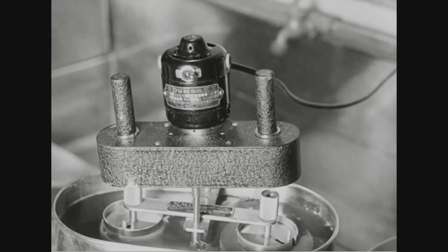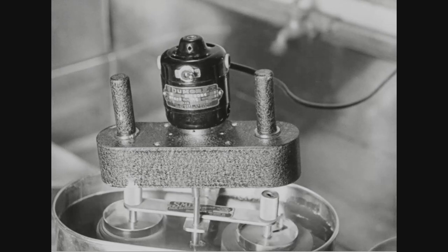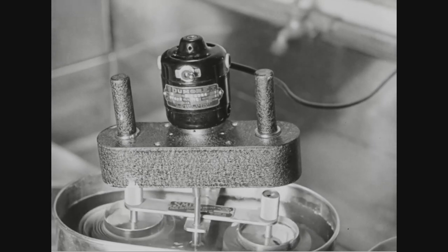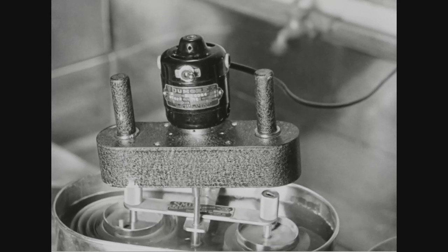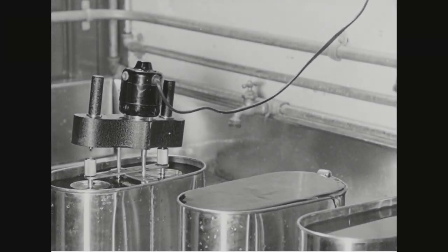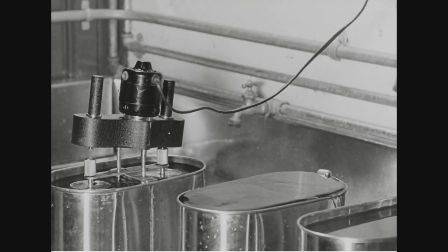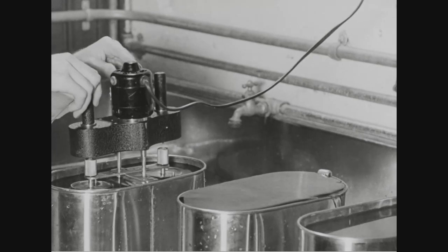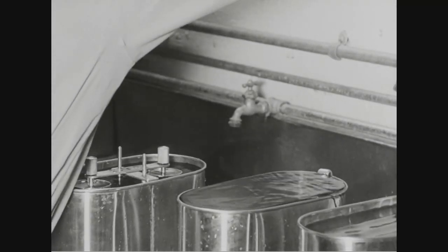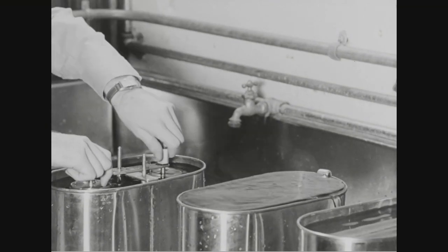When all of the film has been transferred from one spool to the other, the tension created by the fastened end of the film automatically reverses the direction of the drive unit. The entire unit then tips, and the motor drive engages the empty spool and repeats the transferring process. The processing tanks must be reasonably level, or the motor unit will not function properly.